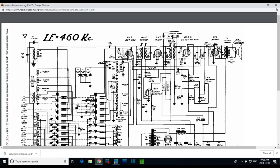And if that's the case, coming from here, that'll push this grid more and more positive. That's very bad for this tube. The more positive the grid, the less the bias on the grid relative to the cathode, and the more current flows through it, not making any sound. It's just quiescent current, just idle current. You can call it that. And if you have too heavy of an idle current here, the tube will run hotter than intended, literally because of the electrons crashing into the plate in huge volumes, generating extra heat in the tube. The tube looks hot to me, but who knows.